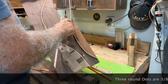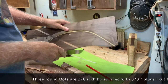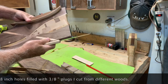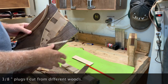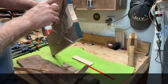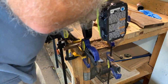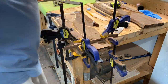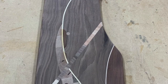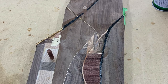I have a couple of pieces sticking out a little bit — I'll cut those off with the bandsaw, just a little trim job. There was a planer error here because we had end grain on the board and put it through the planer — it busted when it came back out. So this has to be cut with a table saw, and we'll do a round-over on that side. Every good charcuterie board needs a handle, so I get out my Forstner bit — one and three-eighths inch — and cut myself a handle. After all the work and sanding and getting it smooth, here's what they look like before we put on the final coat of oil. Just gorgeous.